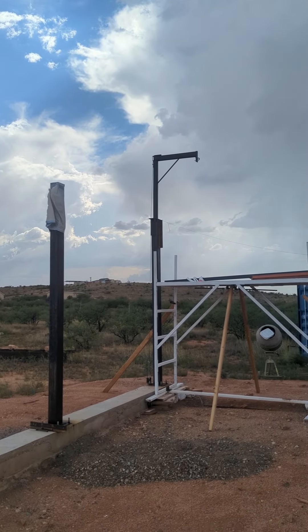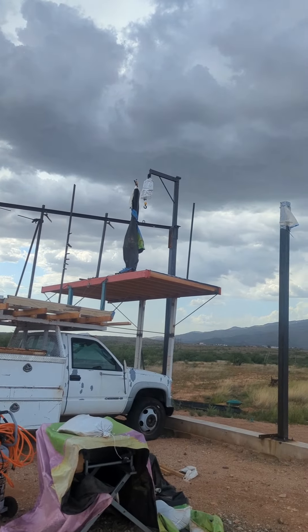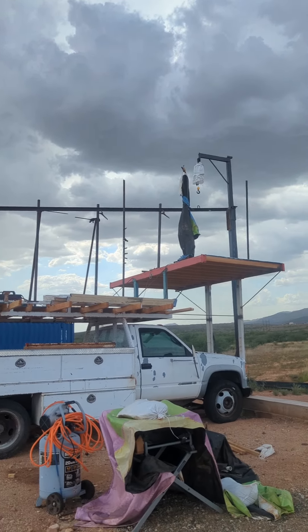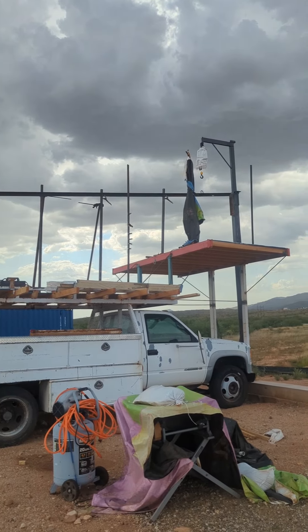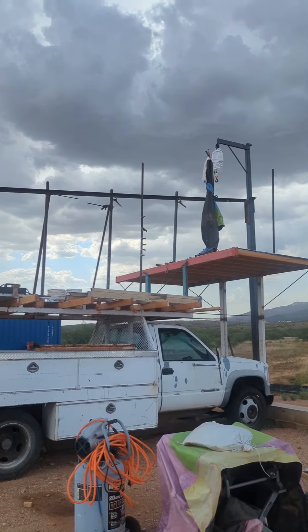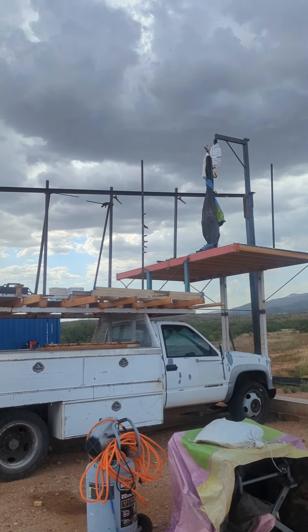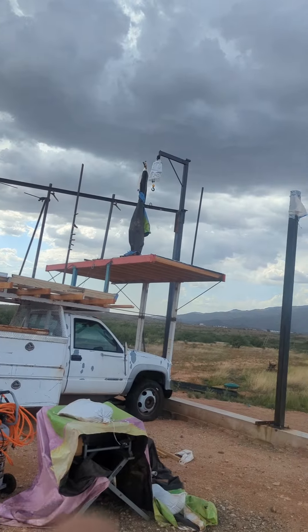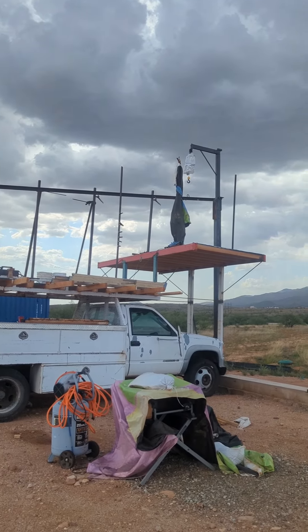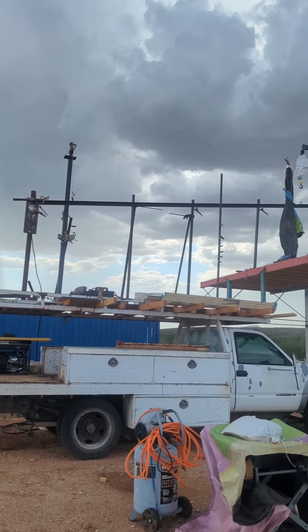So I decided instead I'm going to put a platform on top of my truck and do the fabrication on the spot. This works really well not just for the trusses but for putting up purlins, roofing, and sheathing on the metal too. I can just walk on top of the platform, have sheets brought up there after the trusses are done, set sheets with my tractor, and work 10-foot sections at a time all the way down the line. I'm killing two birds with one stone — it turned out to be a really good idea.